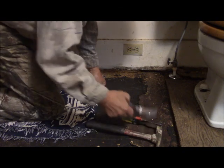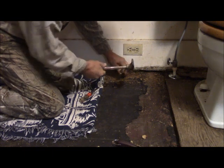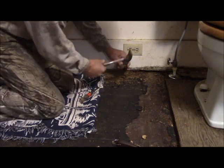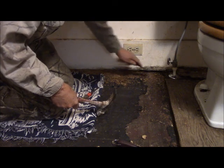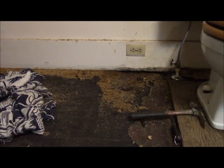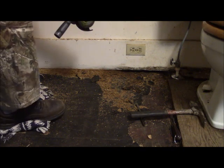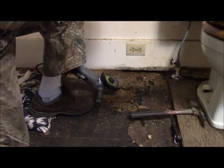There is an electrical line back here somewhere — I want to be a little cautious about that one. Those relieving cuts are healthy. I cleared about another three or four inches, but I ran into a problem running into nails. They put a row of nails underneath the baseboard there. So I'm going to go to the next larger tool, an angle grinder, and see if we can use that to cut some of this excess away.